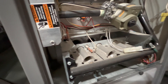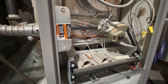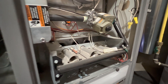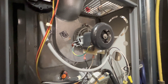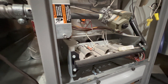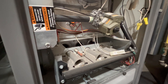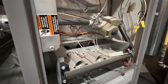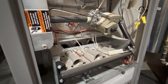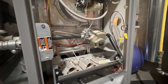After a brief amount of time, the blower motor kicks in. So I am going to go ahead and start this furnace up. And this is honestly one of the weirdest starting sequences that you'll ever see in a furnace. The draft inducer motor kicks on, and the vacuum switch closes. And what's also weird is that the blower fan motor, which pushes all of that air through the home, it turns on before the igniter, which I find very strange. And then another thing to note: the blower fan motor turns off, then the igniter flicks on, burners go on, and then after a brief amount of time the blower fan motor kicks back on, which I find to be very, very strange — but also unique in a way.